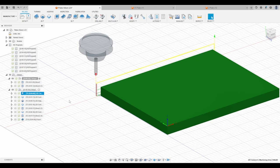At first, I was able to move X back by another millimeter. I didn't quite reach it in the first setup, so I was able to pull X back by another millimeter after the first pass. Then I did the same thing again with the same tool. This is also still the 5 millimeter tool we had in before, so that gained me another millimeter, and then I needed another 0.5 millimeter. So how do you get 0.5 millimeter easily without being able to move your table backwards further in order to reach your zero point in the front?